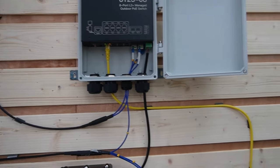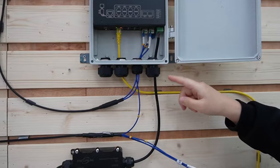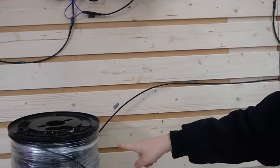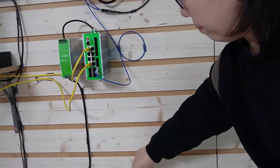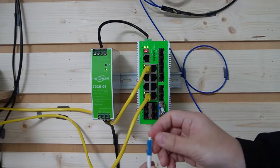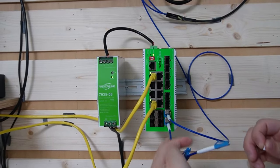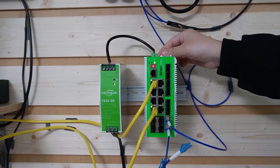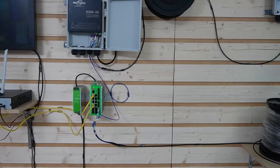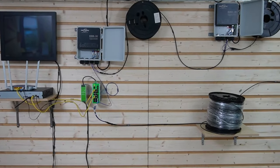This is our bullet camera, and we can already hear the sound of it powering up. Let's go all the way back to point A using a four-strand fiber optic cable. Remember to use string B, and plug it back into point A — our indoor industrial switch. So this whole setup is complete. Make sure on every outdoor switch the dip switch fast ring mode is turned on.